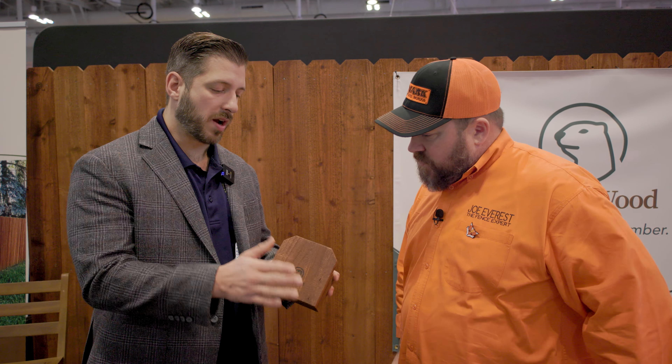So typically when you have a fence, you have a rough-cut picket and a smooth-cut two-by-four. A lot of times you wind up with two different colors even using the same stain product. So we sourced a rough-cut two-by-four, so it's the same finish, and when you get it all done it's a really uniform look on both sides. And I like that the two-by-fours also have a square corner — sometimes it's the little things, but you can butt square pieces together a lot better than rounded edges, and there's a little more meat there too.